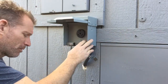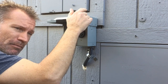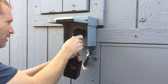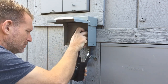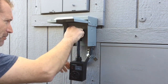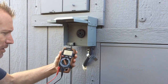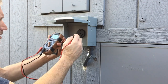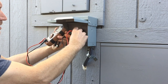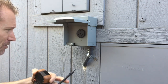Before you begin any work on this, you want to make sure the power is turned off. I've got the main breaker off to the house, and I've also got the breaker turned off to this box. I'll go ahead and plug in my surge protector — no lights. But go a step further: grab your multimeter and check your voltage to make sure your power is off and nothing is coming to this box.